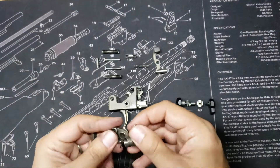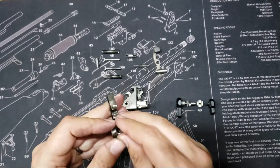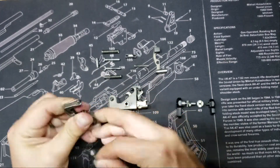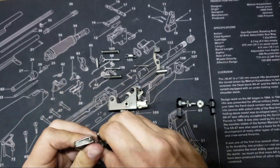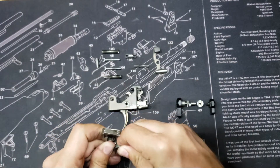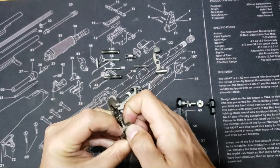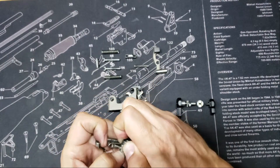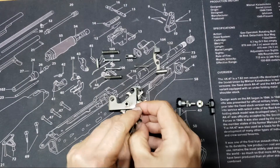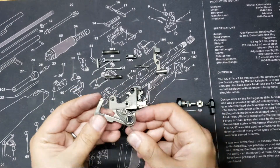The new hammer spring is not the easiest to put on. You have to remember to keep the top loop above that. It seems to be easiest to spread it and stick it over that first area for the toggle spring. After you have it on the first one, you can work on spreading it backwards and going to the second. If it's finally put on correctly, it will sit over the bottom hole.